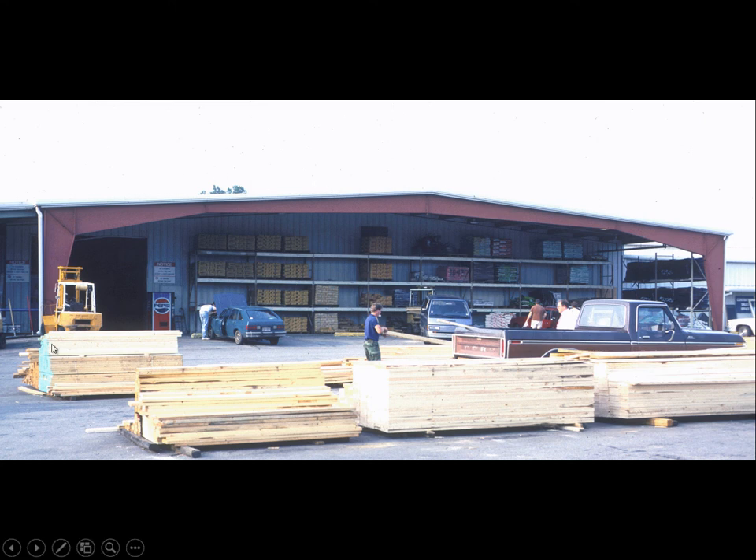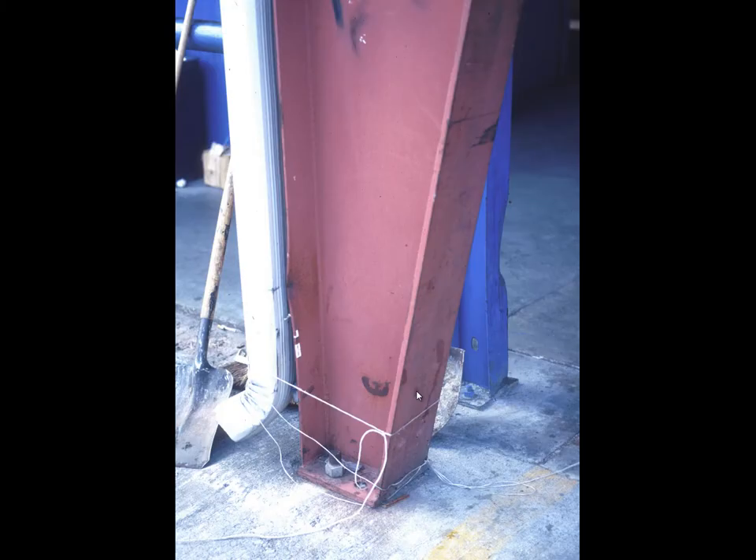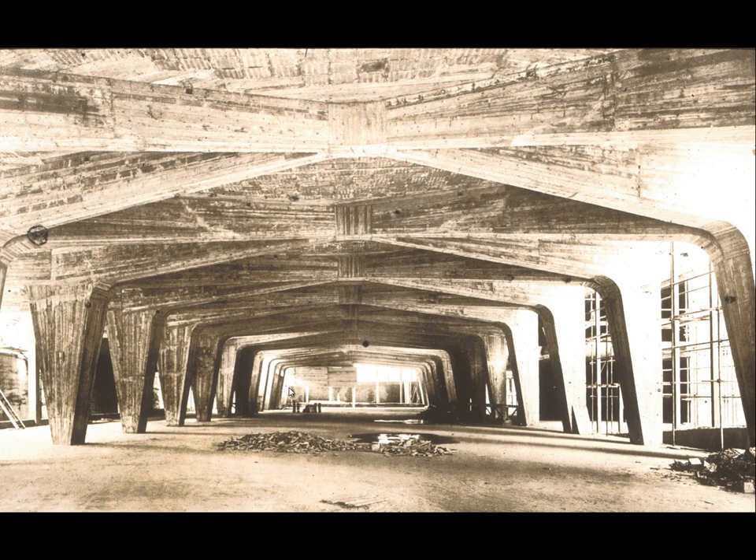Here's another structure based on the same concept: pin joint, moment joint, major moment joint, pin joint. This shows how that joint is put together, and at the base you'll notice they even left out one of the bolts — but it's not crucial because that's not intended to be a moment joint anyway. This is the Pirelli building designed by Pier Luigi Nervi. You'll notice the small base points and the super thick moment joints up above creating the rigid frame. In this case the rigid frames crisscrossed back and forth through the building, working not only to stabilize the columns in the narrow direction but also in the long direction of the building.